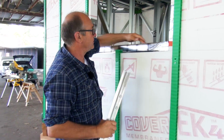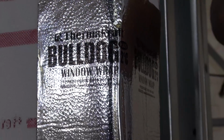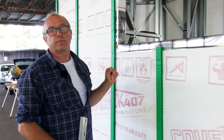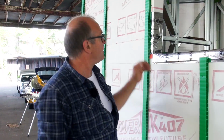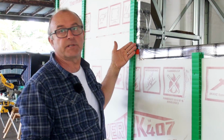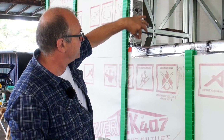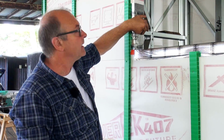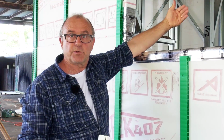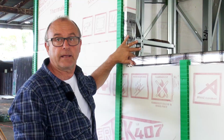Later when we do the inside, we'll show you how to seal. It's very important to air seal the windows from the inside. Often leaks are caused with what we call pressure differential, and the sealing of the air means that any water that gets into here finds itself in a dead zone and then drops according to gravity. If we let the air seal leak, then often we have a pressure difference between inside and outside, and that can act as a vacuum to suck a leak through.